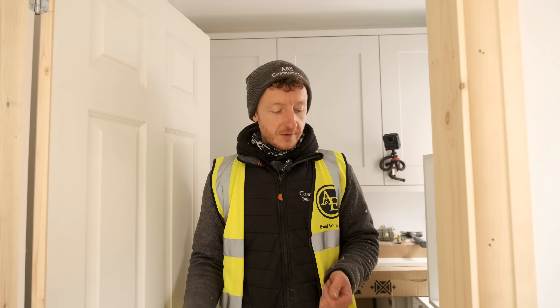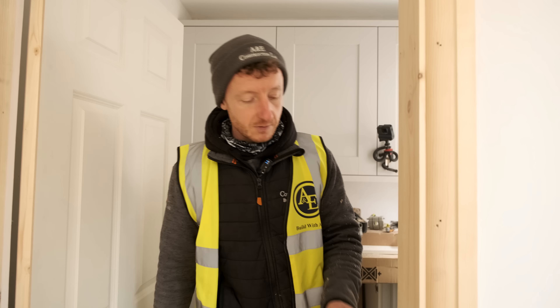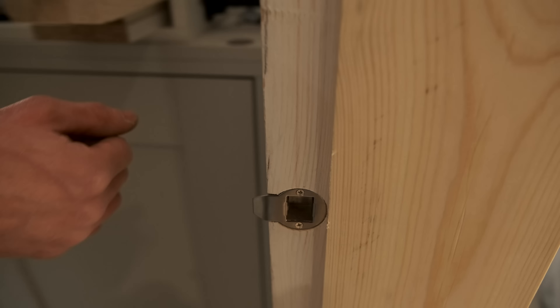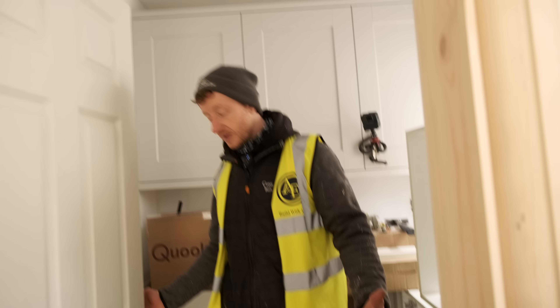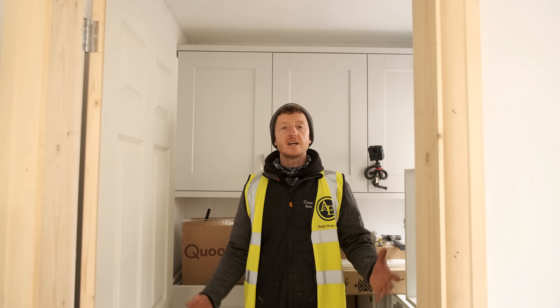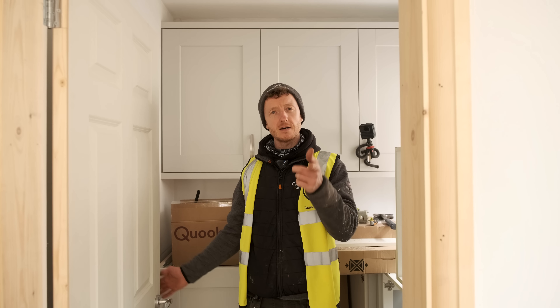In an overview then — it's a great kit. It's comprehensive, everything's there that you need. The only downside I can see with this kit is when you put this socket in, like I mentioned before, the screw depending on the thickness of your door — with this size door, the screw does actually come out through the lining. So it's not the end of the world, you can file it down and the architrave will cover it, but obviously there's a little bit of a down point. But apart from that, everything else seems perfect. I'm really happy with this. Thanks again to Gavin from Benchmarks Joinery — cheers for this, something we'll definitely use in the future. If you've enjoyed this video, please like, comment and subscribe. You've been watching me, John from Build with A&E. Until next time, stay safe.